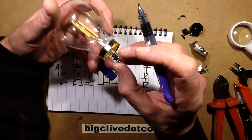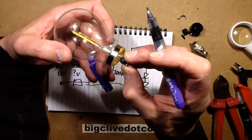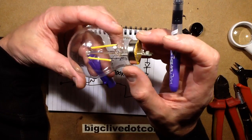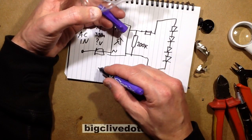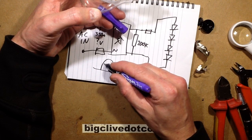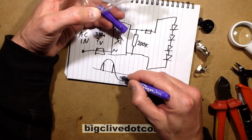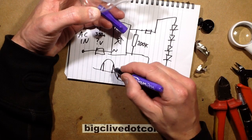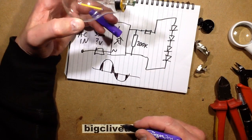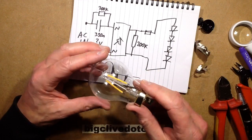I'm pretty sure I have seen this tiny little circuit board used before. That explains why it's quite so flickery — it's running at 100Hz flicker because it's a 50Hz supply. And because the combined forward voltage of the LEDs is relatively high, if this is the sine wave, it'll probably be coming on about here and staying on till about there. So it's going to be dark in these bits and lit in those bits — pretty much near enough 50-50 on-off strobing, which is unpleasant.